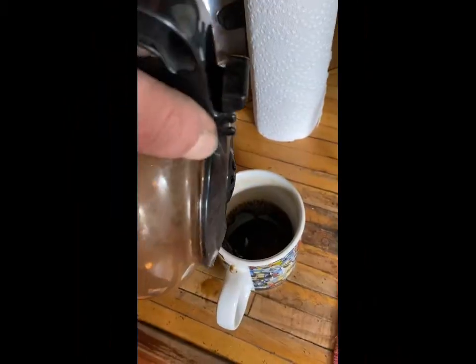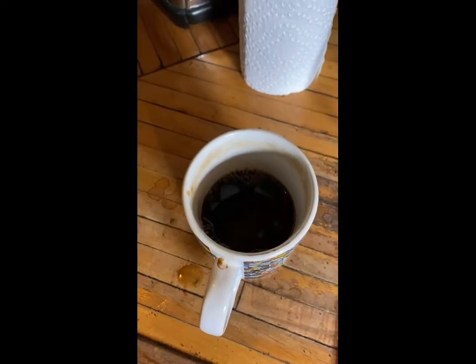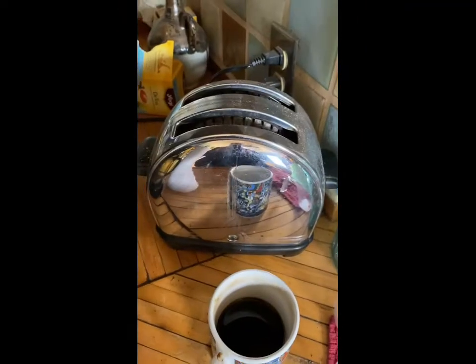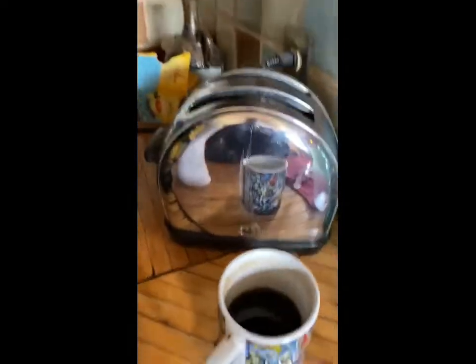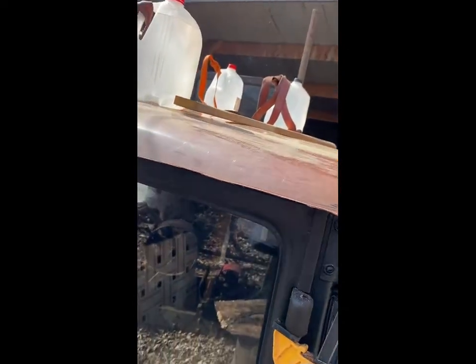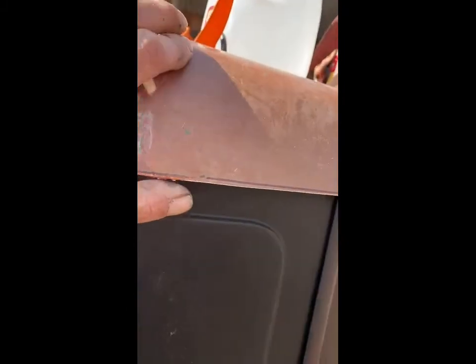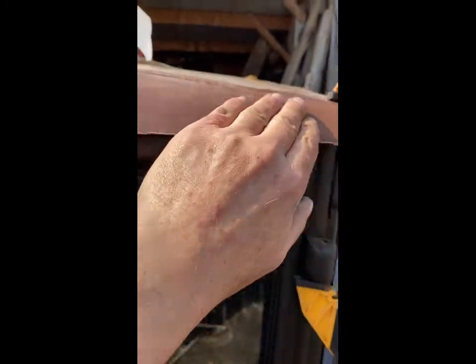Copper sparkle is everywhere — kind of cool. More coffee on the way. Speaking of copper — nickel-plated stamped copper. I don't know if this stuff is work hardening; it's fresh copper roll anyway and it's pretty springy. So I might toss a heat shield up there — some sheet metal — and torch it, heat it up. I'm going to try it again first without doing that though, now that these sides are relieved and not influencing what's going on up here so much.